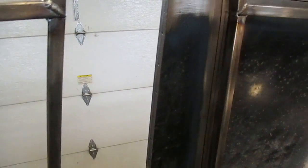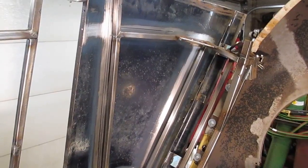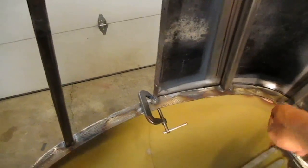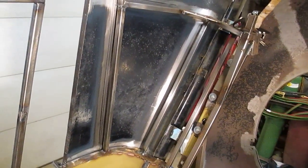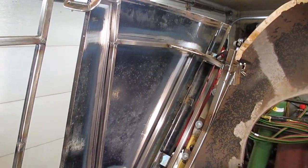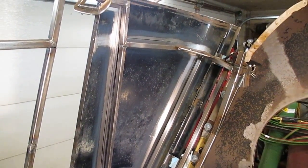These will be easy, but here on the side over here I may have to have it bolt from 2 directions, maybe through here, something like that, and then have a stud on this. So I'm thinking there's probably going to be somewhere in the neighborhood of 13 studs on each one of these, plus a couple of bolts going up through or studs in the front down in this area. So there's going to be quite a number of bolts on each side of this thing, but I think it's the best way to keep it from flopping around and make it secure with some really small studs, and then I can put shims on them.